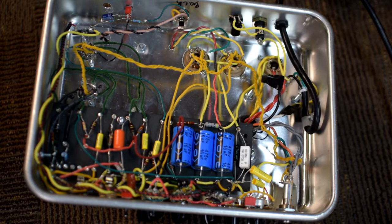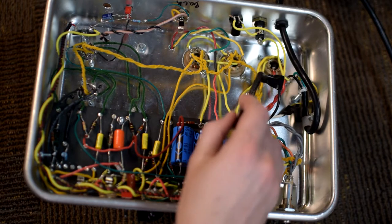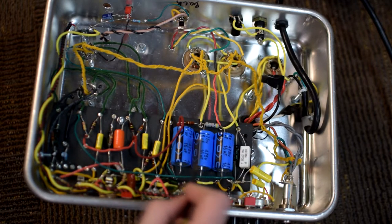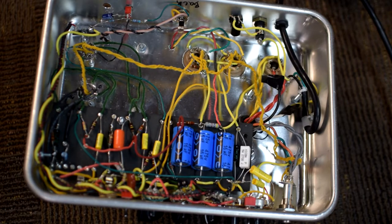So now next comes the rectifier. All tube amps will have a rectifier of some kind that will take that alternating current and rectify it into direct current. Rectification will typically take your AC voltage rating and increase it by a factor of about 1.4, modifying it into a rough form of DC. So if you had 350 volts AC, that's going to be 500 volts DC at that high current, maybe a 100 to 200 milliamp current rating. So that is really the danger and the concern there. That's going to be coming out of one of these yellow wires going right here to these three filter capacitors.